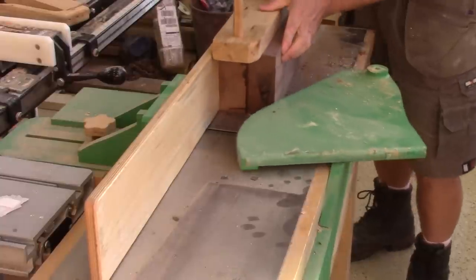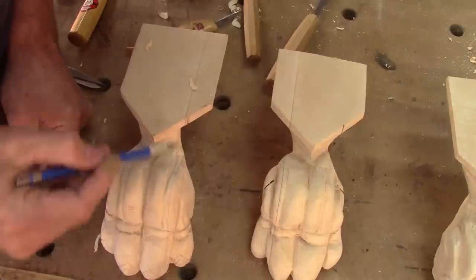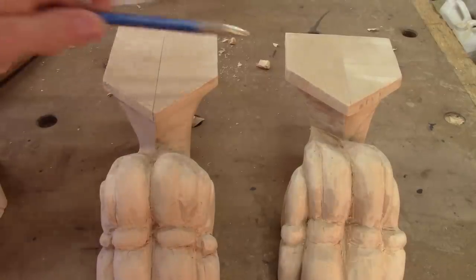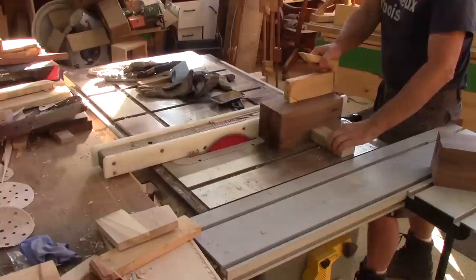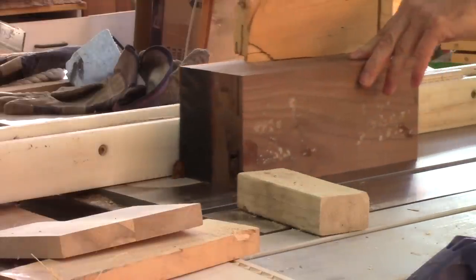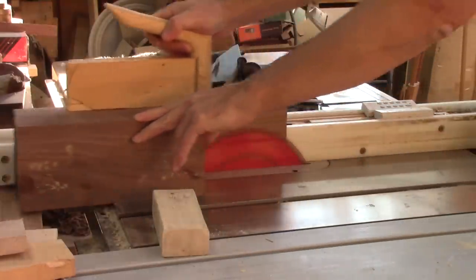When it is dry, it's far from being ready because they need to be cut to the right size. On two of my tests, I didn't take into consideration the glue line, and this looked like crap. But on the other two, the glue line is dead center and disappears between two fingers. So I'm going to cut both sides of my blanks. Before goofing things up, I check if it's the size of my pattern. Since it is, I finish the cuts.